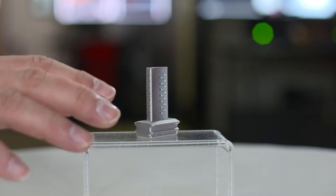I'm guessing you'll use 3D scanning to scan this 3D part? Correct. At North Star Imaging we can do 2D, 3D, and 4D scanning, and for this sample we will be doing 3D scanning so we can get a clear view of the internals. Do 3D printed parts require a different approach or technique to scan? Nope, we can set it up exactly the same as if it was cast or molded. It has less to do with how it was made and more to do with what it is made of.